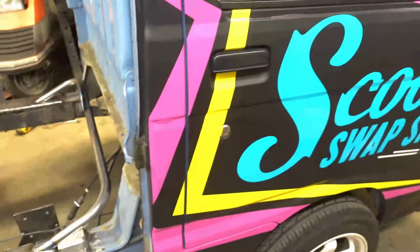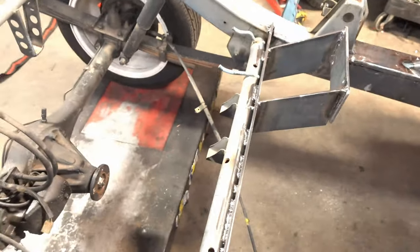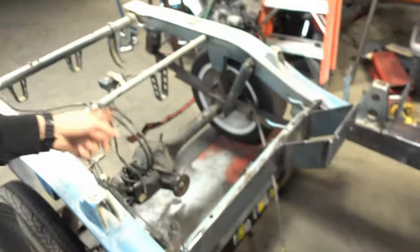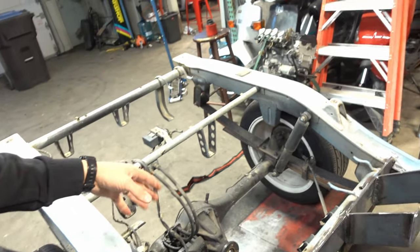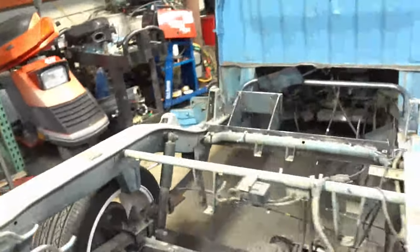Thanks for watching. If you guys have any suggestions, tips, or you know buddies that have done this — the one variable that we don't know yet is reverse. Somehow we have to get reverse in here. There's some people that use an electric starter like off of a 454, and then they weld a ring gear with teeth on it, like a mini flywheel, to the drive shaft. Then they hit it, it engages and spins. But I don't really want to invest a bunch of money and bracketry into this diff because it's going to explode. Maybe without reverse for a little bit. There are some billet solutions — there's a couple companies in Europe that make reverse boxes, but they're about $1,000 a piece. We would rather not spend a grand on reverse, but we may have to. Anyways, thanks for bearing with us. Stay tuned for the next video — my guess is you guys will probably hear this thing start up at least.